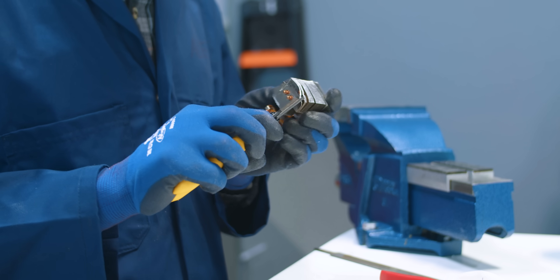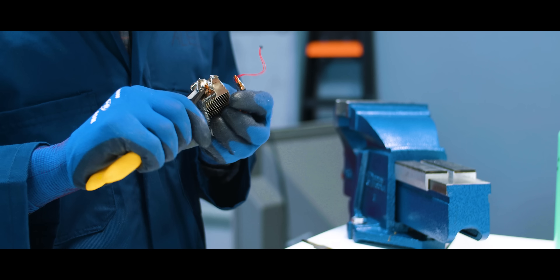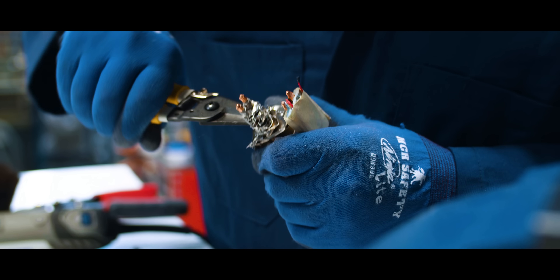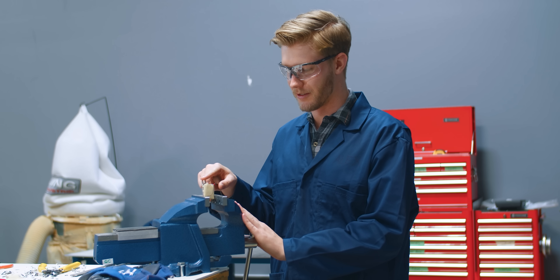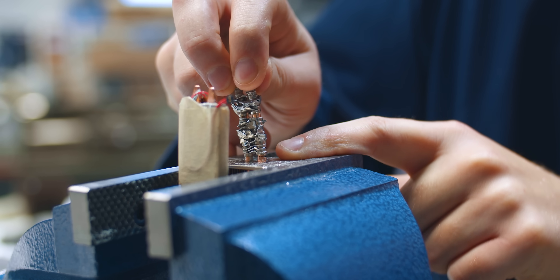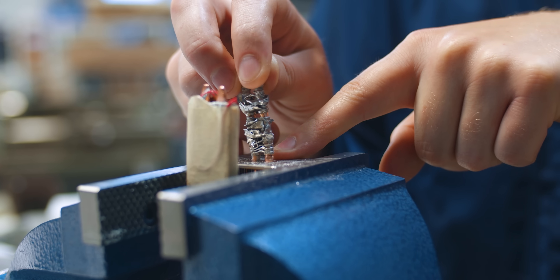Actually, maybe snips aren't the worst idea. A material like copper, which is what these heat pipes are made out of, does this thing called work hardening — bend it a little bit, then a little bit more, and it slowly becomes harder and also more brittle. This right here is a perfect example of that. It just snapped right there, which means my job just got a whole lot harder.